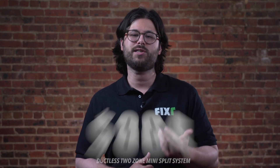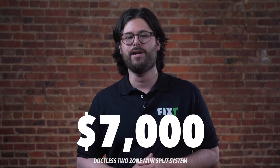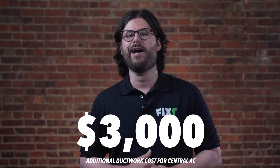If you're debating between getting central air or a mini-split system, here's the rundown. If your home doesn't have any ducts installed, mini-split systems for up to two zones can cost between $4,000 and $7,000 for a 2,000-square-foot home, depending on the brand. Central air units will cost close to the same amount, but you'll have to pay an additional average of $3,000 for ductwork. Also, because central AC cools your entire home, it cools rooms which may be unnecessary, wasting energy and increasing your bills. Because mini-splits are focused on one specific area, they're more efficient and could be easier on your utility bills.